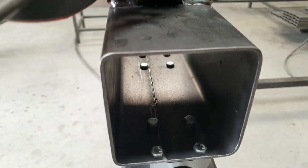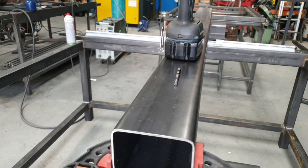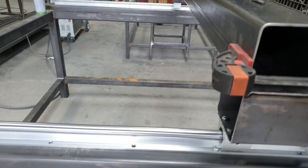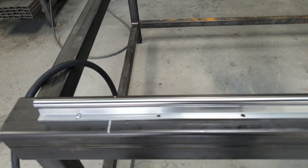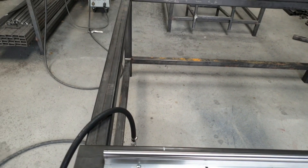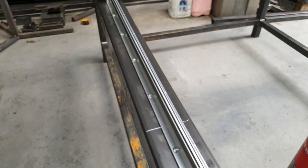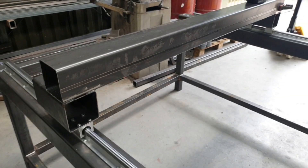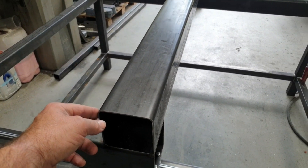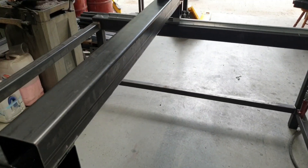I'm fixing it like this — makes easy access, easy maintenance. It's not super heavy. It's 100x100x3 box section, as you can see. These come in 1500mm lengths. A little bit tricky to set up — you've got to make your frame dead square and not 3mm out. It's easy enough to do if you are very, very fussy about your measurements.